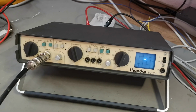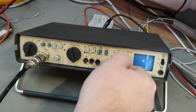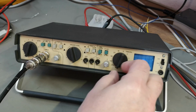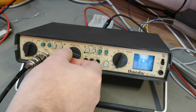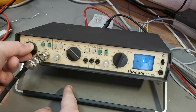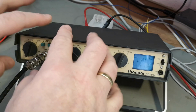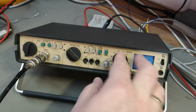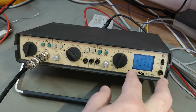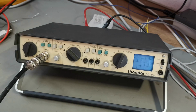Okay, I think I figured this out. The time base here is not responding in any way. So that has something to do with the problem, right? And when triggering is working, see if I crank down the signal until, see, now there's a trigger. So now it actually tries to start the time base, and the time base is not working, so that blanks the screen, right? So that is what is the problem so far.